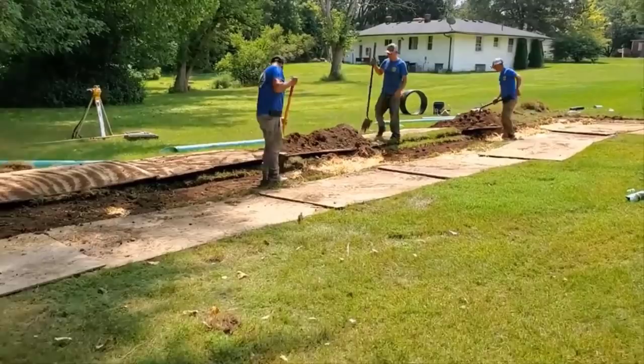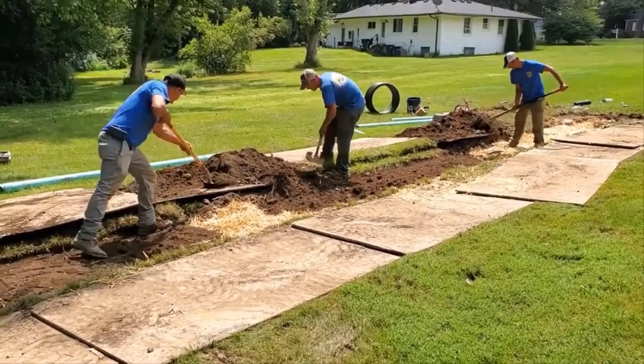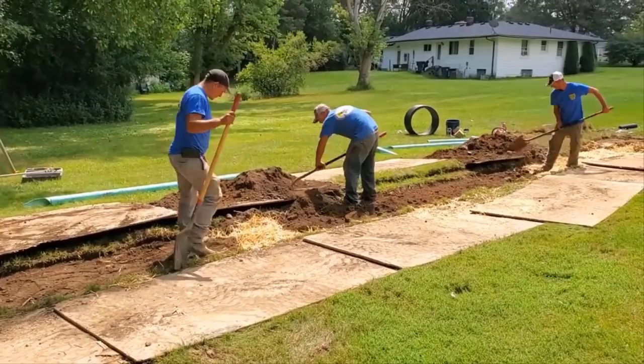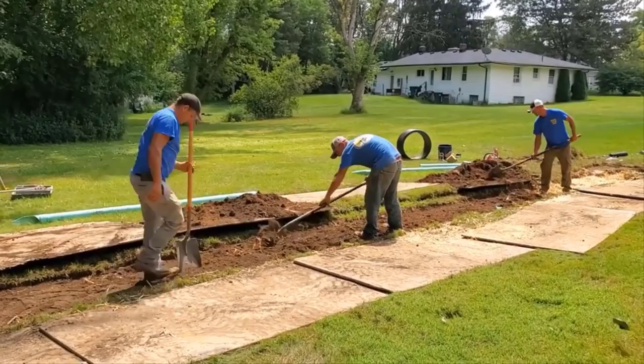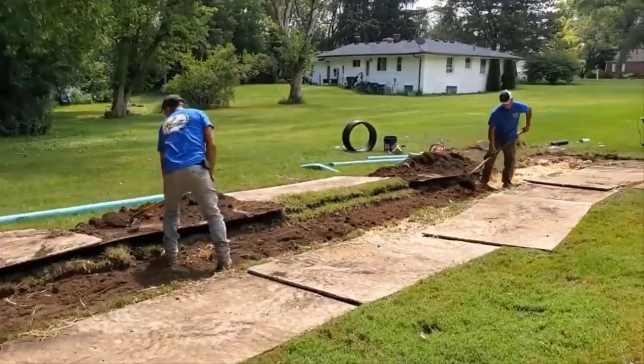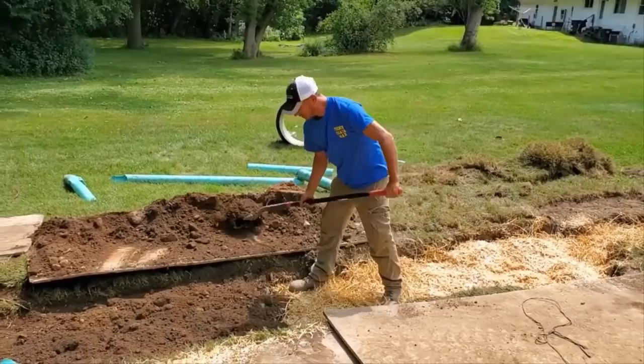Canadians, Canada, this is the ideal way for you to do a leach field. Just the way we showed you. We have the stone base. We have the level fingers. Now, if your percolation is really bad, or say your sump pump discharge line runs nonstop, well, then this field gets bigger. That's what happens. When the soil doesn't perk at all, now the field's going to get big. If the sump pump runs all the time, now it's going to be huge.